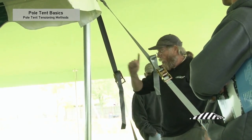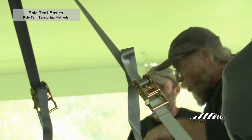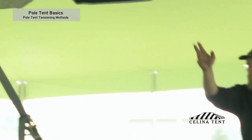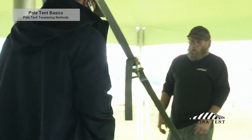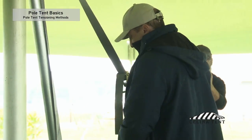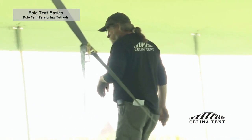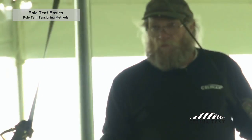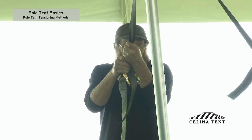And then again, as I walk to that corner, don't put the blinders on. You want to walk around on the outside. You want to take a quick stop here. Am I lined up? Yes, I'm looking pretty good. Everything still is shifted this way, and it should be because I haven't tensioned here. So then I'm going to get down to this corner, and I'm going to tighten here, right? No, we're going to go here. I'm going to pull against the corner that's already been set.